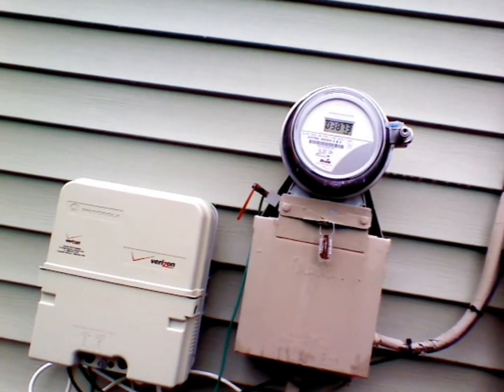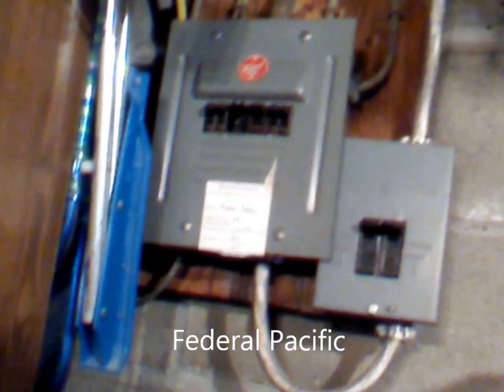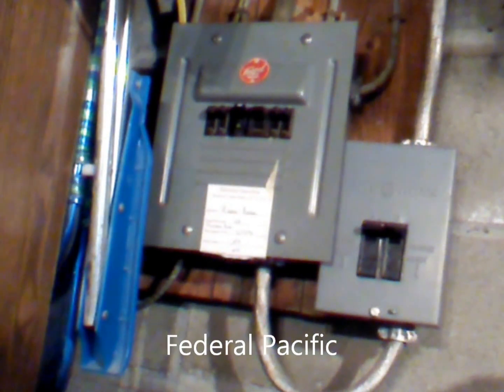So it should be pretty well worth the money and time to do it. Here's my main circuit breaker box — six breakers, no main shutoff switch. The box to the right is from my central air. This box was added to the house in 1958. It served 1,100 square feet. I've since then added another couple hundred feet in my basement as living space. This thing is nowhere near adequate enough to power my house anymore. It's just a fire hazard, so it's going to be upgraded. Time for it to go.